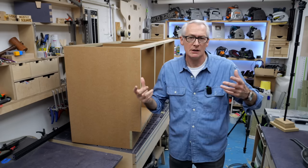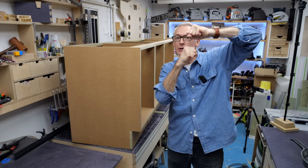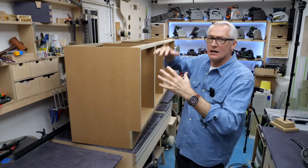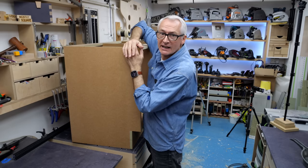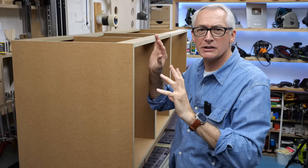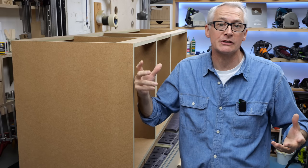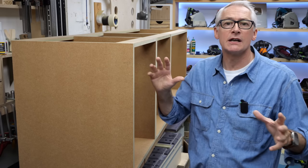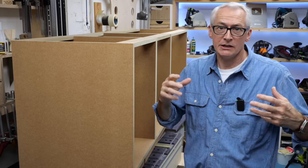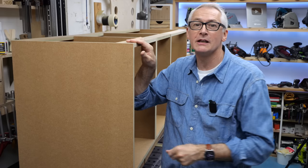In the previous videos, we talked about the forces acting on a wall-hung cabinet as being downward, trying to pull the cabinet apart. But here, the weight on the base cabinet is also downward, but trying to push the carcass into the floor. Now, I've just butt jointed the base and the stretchers into the sides. Some folks will set those into housings or dados for extra strength. But as makers, I think we tend to over-engineer things, and you'd have to be catering for some very serious loads to make that worthwhile, at least from an engineering and mechanical point of view.